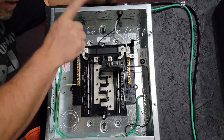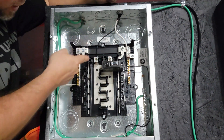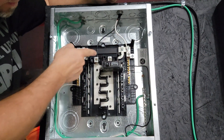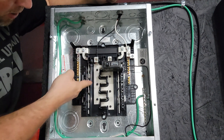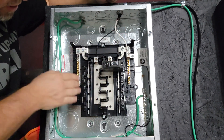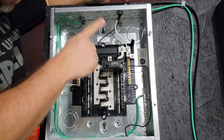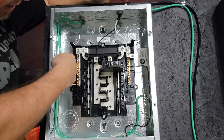Because we've only got one unit and it produces 110 or 120 volts, we can only hook up one side of the bus bar. If we had an additional unit we could hook up the other side and create a 240 or 220 volt system — both bars would be energized. In this case only one bar is energized. For the neutral, I put it over here on the neutral bar — any neutrals we have just connect right into those bars.